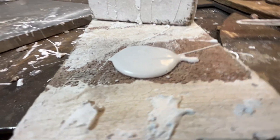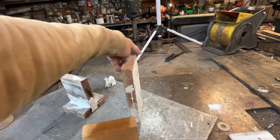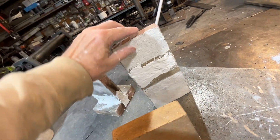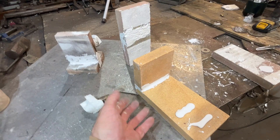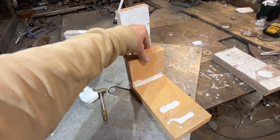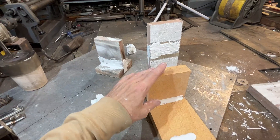We're going to come back to this stuff. I'll show you what I mean by how hard it is to take apart. This brick we just glued together two minutes ago was in three pieces — a small center section and then the two big pieces. This is a very non-porous, very dense fire brick. It did not like the dry batch of glue; I had to add a little bit more potassium silicate. It does feel like it may be sticking, though a wetter batch may be needed for this.